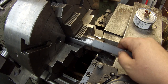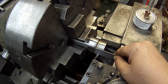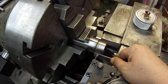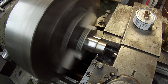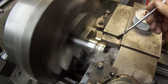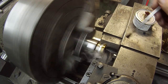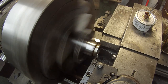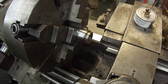So the plate's a quarter inch. I'm going to part it a little bit long and make a face cut. I'm using the scale and I've got it set at about 5 sixteenths - we'll part that bit off right there. Running at 180, just hand feeding with quite a bit of pressure on the tool bit. Parting tool out, I'm going to put a turning tool in.